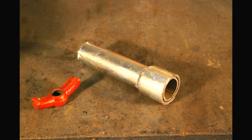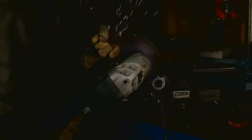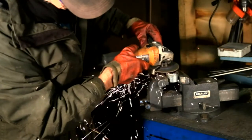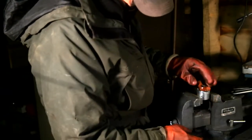The one improvement I could make to the jack is to give it an axle saddle to prevent the possibility of it slipping out when jacking underneath the axle. I don't want to make the saddle permanent because there will be occasions when I don't need it, so I'm going to make it removable. I will use the saddle from the old Corum jack and make up a collar using this off-cut steel which you see here. I firstly need to cut off the collar. Well, that didn't take long. I'm now dressing off the sharp edges, and I need to shape it in order to take the axle saddle. Well, that's a good fit.